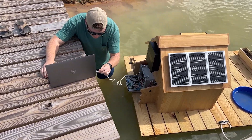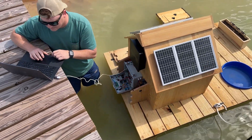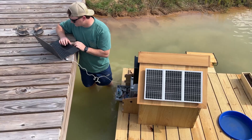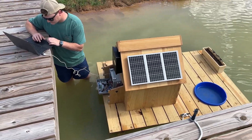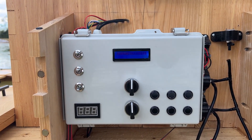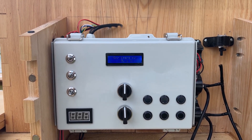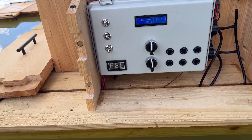I got my laptop out and downloaded the final revision of the program. If the toggle switch for the LCD screen is on, most of the sensor data will cycle through on the display. Since we know the actual time using an RTC module, we were able to set times for tasks like watering the garden, daily pool cleaning cycles, and times for all the lights to come on and off. Another cool feature for data nerds: every 10 minutes we log all the sensor data to the SD card — roughly 144 data points daily. If you have any ideas for what this duck house is missing, comment down below so I can add them for phase two. As you can see, the fish are already big fans of the duck house.